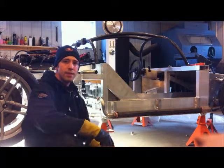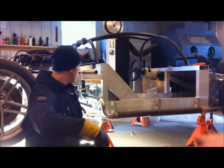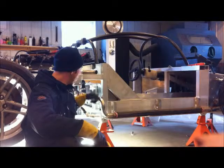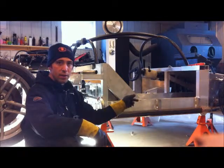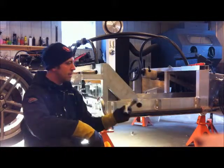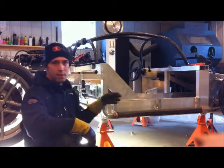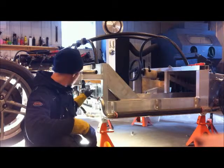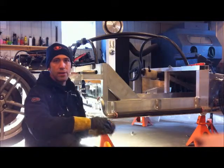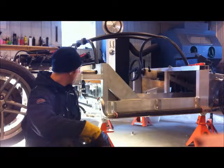Today we're going to talk a little bit about the coolant system. I fabricated the right side last week. I didn't take any video, but I wanted to show you here how it was done. Instead of running flex hose in the back of the car and also the front of the car and around the problem areas, we use pre-bent tubes like these. We cut the 90s, 45s, etc. and follow the bends and contours of the car. So our coolant pipe, right off the waterway here, water pump, all the way to the front of the rad will be one continuous stainless steel pipe, 1.5-inch pipe.